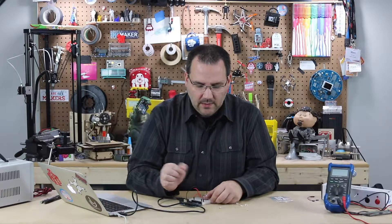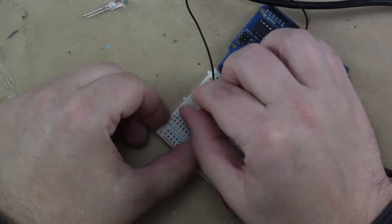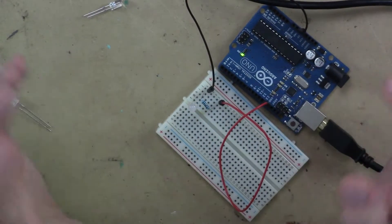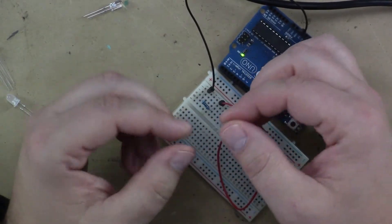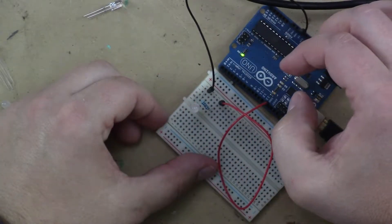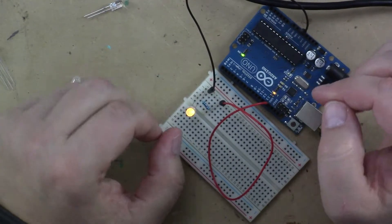What's interesting about them is I can actually wire them up backwards. I'll just give it a spin and put it in there — and now it's blinking yellow. So really interesting: the long lead is not the positive and the short is not the negative. They can actually work either way. Depending on which way you plug it in, you get red; spin it around, you get yellow.